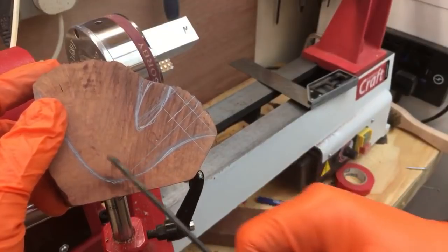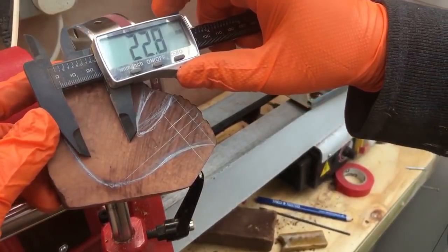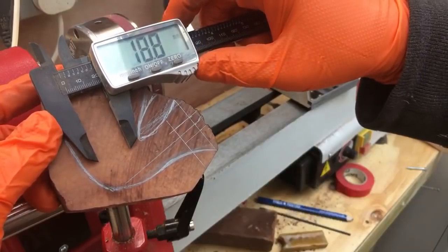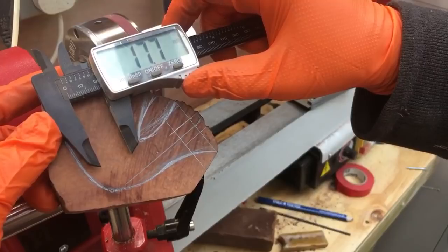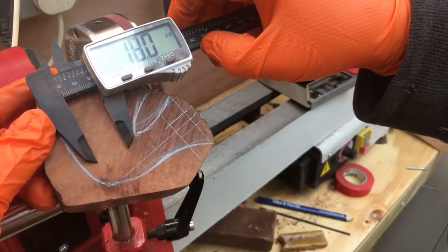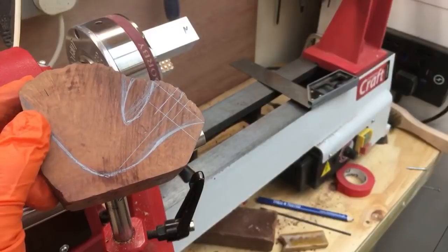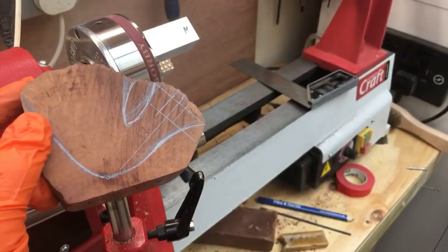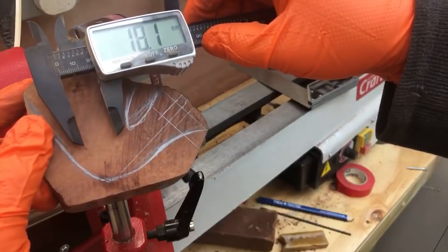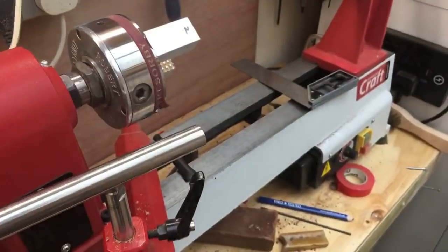That's actually quite narrow, thinking about it. So if that's going to be 20mm, let's see, I did a 20mm bowl. That's going to be too narrow, so I might go for an 18mm. Go for 18mm. That's a lot better. It's going to be quite a deep bowl. A 16, I've got a 16mm bit, but I think it's going to be too narrow. So I'm going to stick with 18, but I do have to get down to this point in order to meet the draft hole there. So that's that. So we're going with 18.